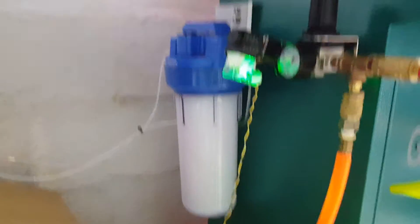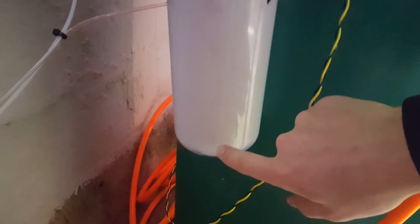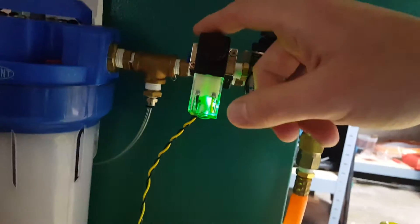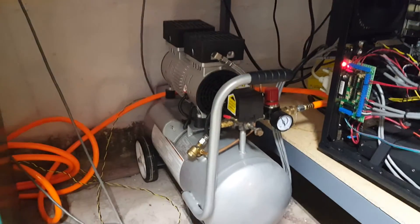It goes up and around — there's a little curly-queue over here; I need to do a back loop so it stops siphoning back down. Down here I have a Dupont oil filter housing where I took the filter out. I drilled the fitting out so it goes all the way through, and it's teed off — regular air goes here, solenoid valve from some valve company off Amazon, then a regulator, then a tee, and then I have my air wand.